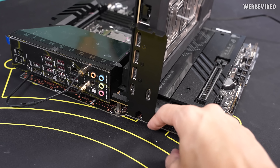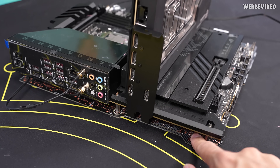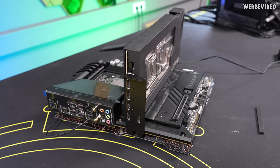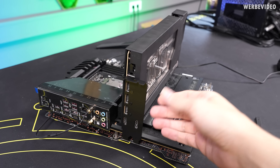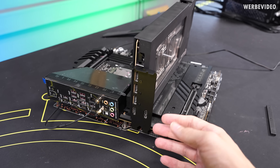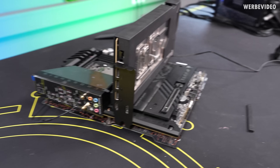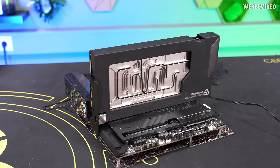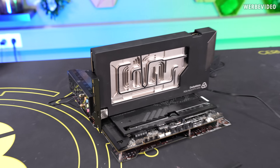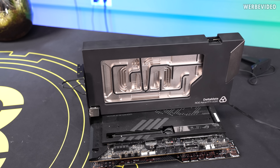The IO bracket finger reaches lower than the motherboard itself, so it would just hit the desk if nothing was underneath to elevate the motherboard. In the past I was often lazy — I used to just remove the IO shield completely, so in old videos I have cards where the motherboard sits directly on the desk. If I was extremely lazy, I just bent it up. But at some point I thought: if you have some 2000 euro GPUs, you should maybe not bend parts, especially when you sometimes have to return them. That was the point where I decided to do something properly.